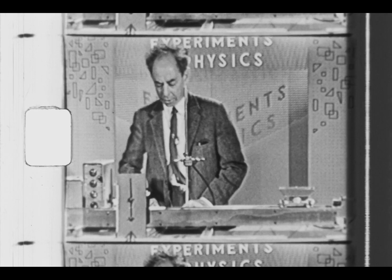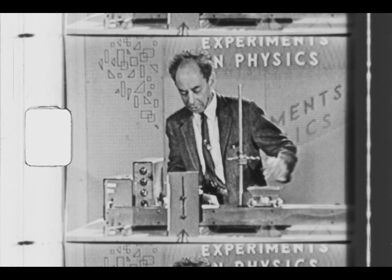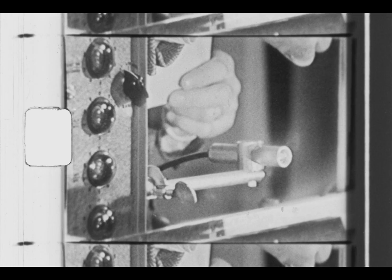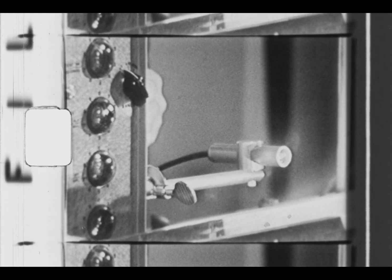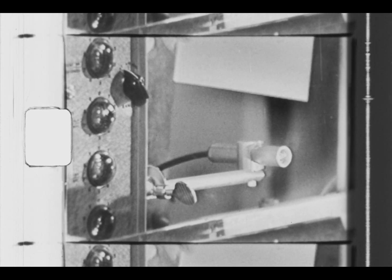Finally, one wants to be sure that the photocell is working properly and that the light is being interrupted at the proper time. First, it's well to put one's finger through there and make sure it stops promptly. Sometimes turning off the light will start it, but it won't stop properly. If that's true, one has to readjust the height of the light itself, or the photocell.